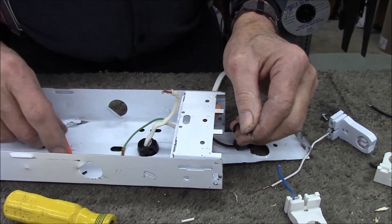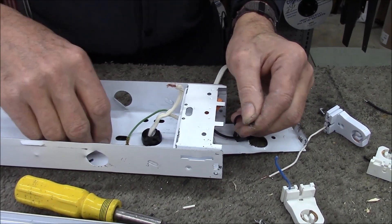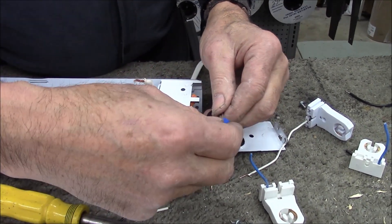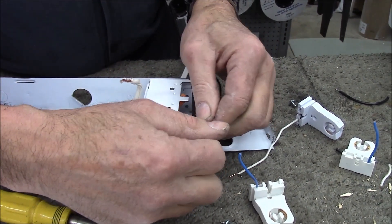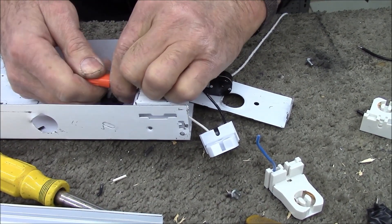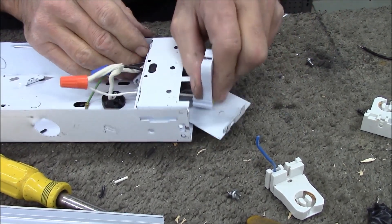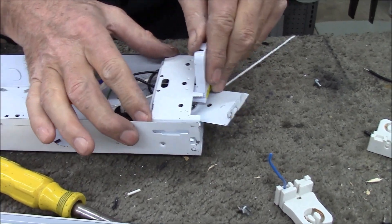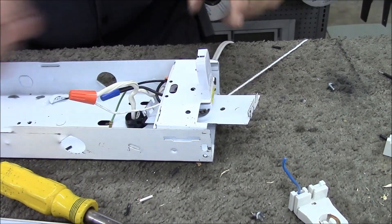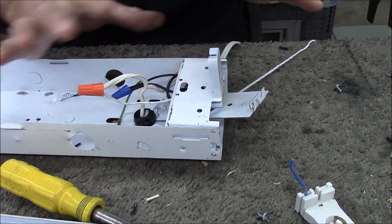When doing a couple of small wires, you need to go to a smaller wire nut. The orange wire nut is good for heavy wire to light wire, but when going light wire to light wire, you need to go down another size. Whenever you use a wire nut and tighten it down, always check to make sure the wires don't pull out. The biggest mistake homeowners make is not having the right wire nuts in advance — they put something together that doesn't snug up safely and just shove it in anyway.